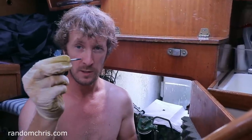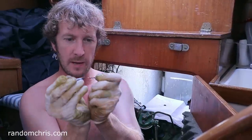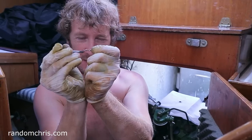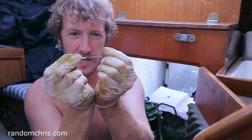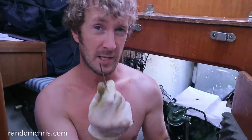I'm now going to use a small screw extractor. I've selected a drill bit of the correct diameter — in this case a 3.2mm drill bit; it depends on what size screw extractor you're using. I've got some Cobalt drill bits — they're 5% Cobalt and much sharper than standard HSS drill bits. They will last a very long time if you drill at the correct speed; they're really good drill bits and worth the extra money. I'll put a link in the description to a set of Cobalt drill bits on Amazon. Just be aware that especially the smaller diameter bits can snap quite easily, so you should wear eye protection.